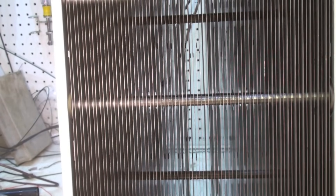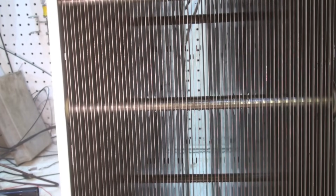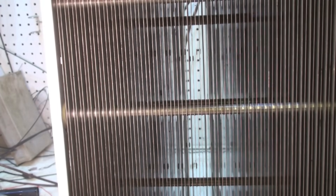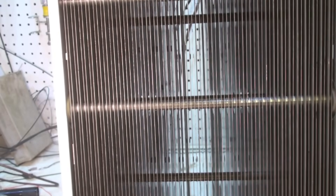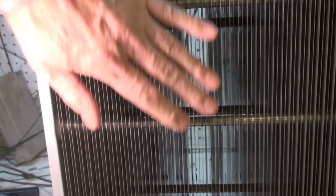This cell has just been cleaned and it's not dry yet. There are two ways to deal with this: one is to just let it dry for a couple of hours, or you can put it in the furnace and turn the manual fan on. But do not turn on the electronic air cleaner, because it tends to damage it — it's going to spark, and since these things are wet, they're going to short out and it could take out the control.